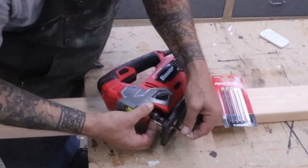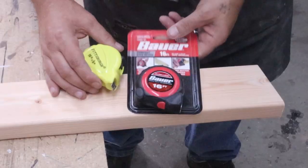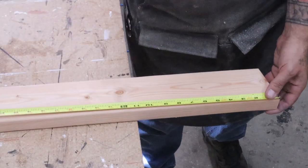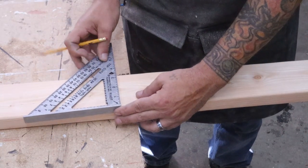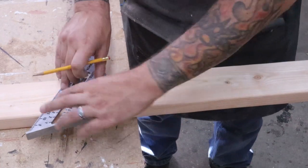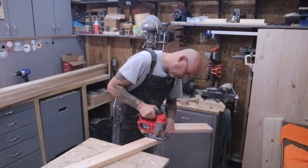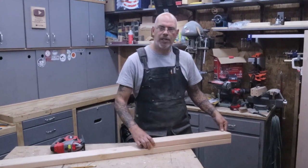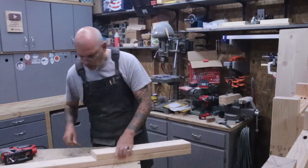Then it's just a matter of loading up the jigsaw, putting a new blade in, and making the cut. Take your tape measure and measure 23 and a quarter inches from the long edge and put a mark. Take your square again, put it on the mark, go to 15 degrees from the pivot point and mark it. Make your cut and this leg will be done. Take this piece, lay it on top of the board we just cut, mark it, and cut that leg — continue that for all four legs.